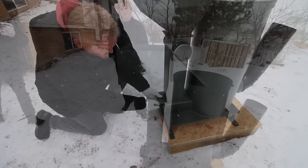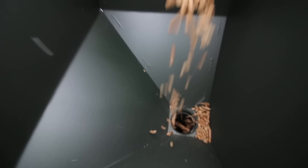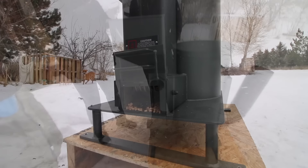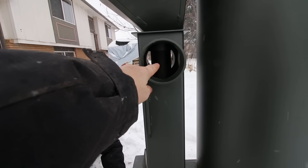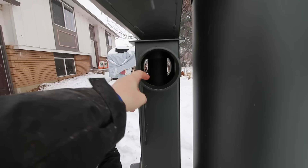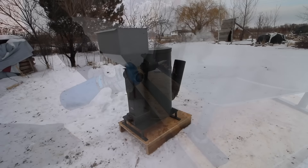Okay, let's make sure that the grate is in there and facing correctly. That is like 20 minutes worth of building. Those are the air intakes. So the tube itself — the air goes down the tube — that is what holds the pellets. This square tube is not full of pellets. The tube inside, the circular tube, is full of pellets. That way you still have air intake down the sides around the tube.